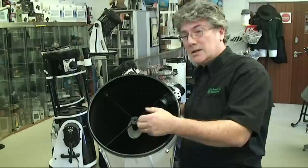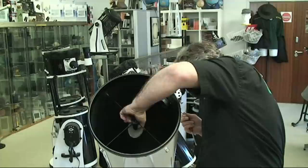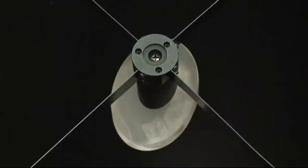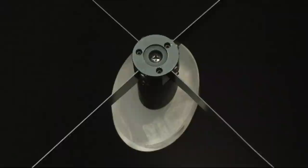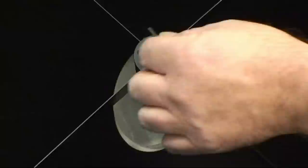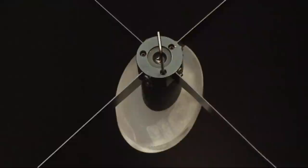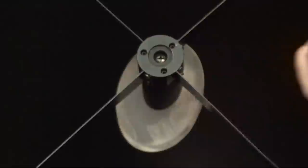That's more or less lined up now. The secondary mirror has been rotated correctly, so I can see a reflection of the primary mirror through the eyepiece. The Allen keys are used to actually tilt the mirror — it only ever really matters to adjust these. It works like a milking stool: if one leg is in position, you can get every other position by shortening or lengthening the legs. The Phillips screwdriver is to tighten up the center so that everything's locked in place.